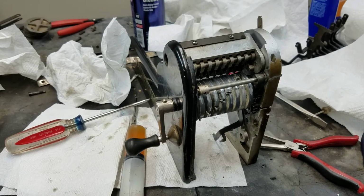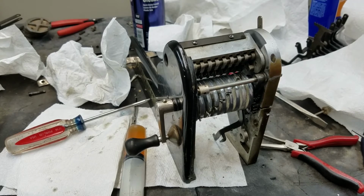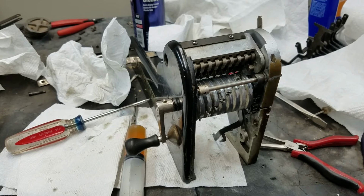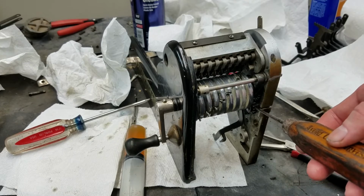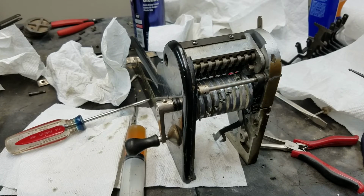So it's really not that complex, compared to something like a Madas or Frieden that has individual drive shafts for each digit, or I guess Monroes are pretty similar in their lack of complexity. The Monroe drivetrain is pretty simple too. This is definitely much simpler than a Frieden. Another machine that would be, or the Silent Speed too. The Marchant Silent Speed that superseded this style of calculator had a way more complex drivetrain than this, but this is a pretty simple drivetrain.